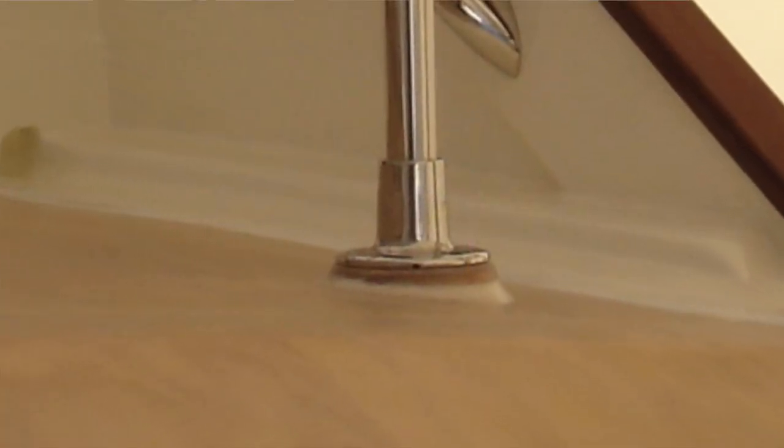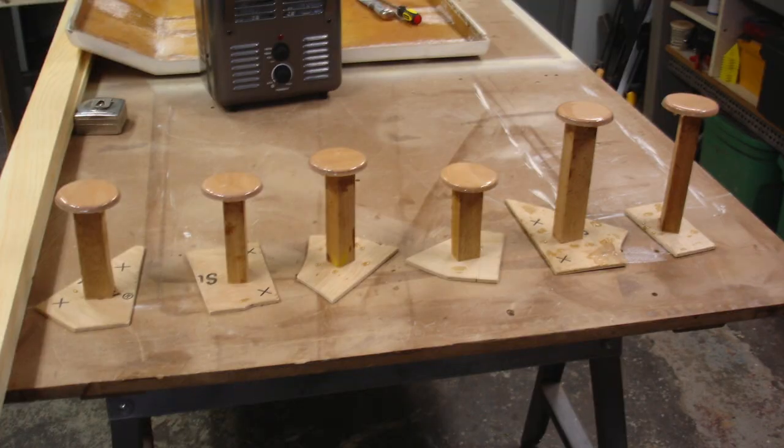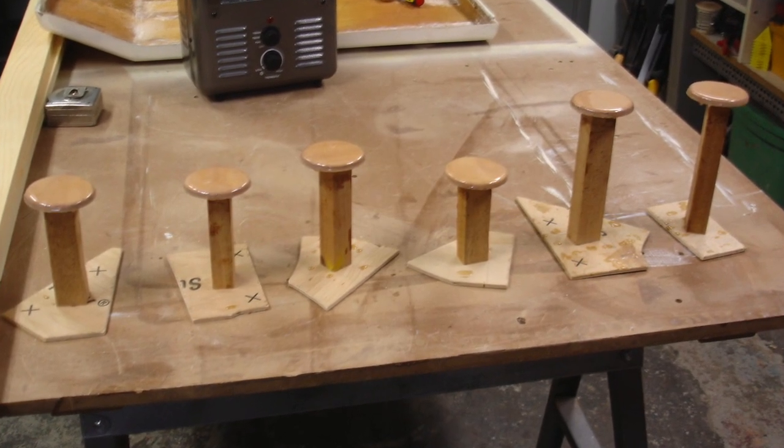But before that, I'll have to mention that under all the base fittings, I installed what I call a leveling pad. It's basically a quarter inch piece of marine grade plywood that I cut out with a hole saw on my drill press. And in the photo here, you're seeing it pre-fiberglass before I actually install them. So I put these under all the base fittings for the guardrails.